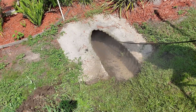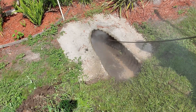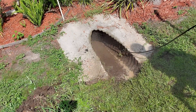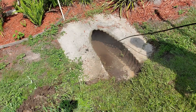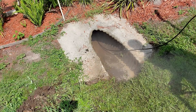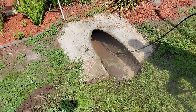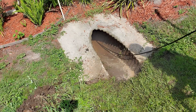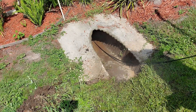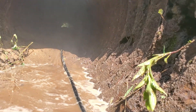This is a really great project for the do-it-yourselfer. If you've got a culvert going under your driveway, you just need your pressure washer and you can order that little mini jet on Amazon — they're only about six or seven bucks. You need a hose to go with that; we use a 100-foot hose but you could use a 50-footer. It's three-eighths of an inch and it really builds up the pressure. It works great — I'm surprised how well it works inside this huge pipe, since the mini jet is designed to clean much smaller pipes.